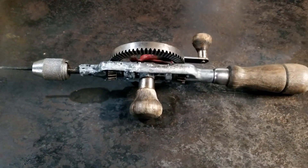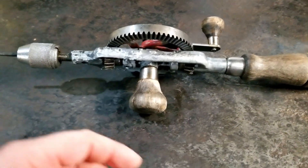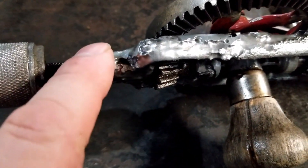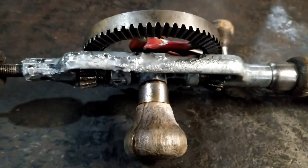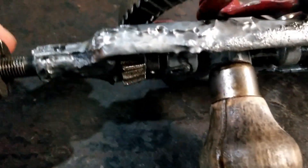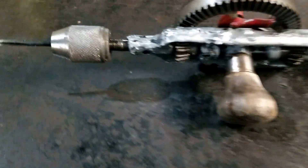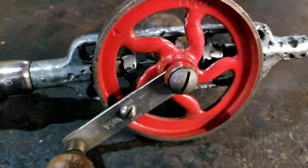Hopefully this video helps you if you ever got an old hand drill that's a little seized up. Just be sure — don't do like Mongo — if it's magnesium, don't put magnesium in vinegar. But if it's aluminum or steel, sure, throw it in there, it'll loosen it all up. If you like this video, be sure to like and subscribe — Mongo is always working on all sorts of stuff.